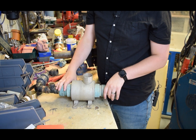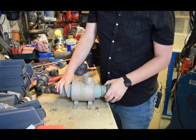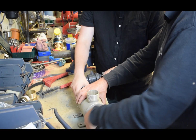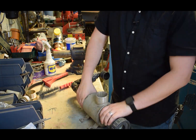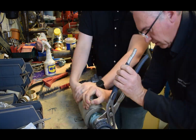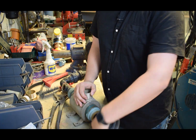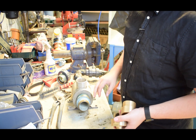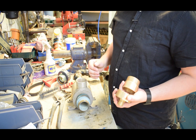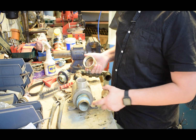What we're probably going to do is take them all off and give them a wire brush - probably get them off first because they're quite stiff. We did manage to get this moving; just a bit of wire brush and WD-40. Again, while we do it in bronze you can actually get it going again, because it doesn't corrode as badly as steel when it seizes up.